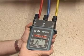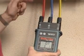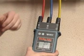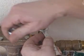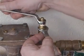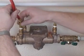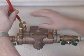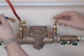The test kit has 3 control valves and corresponding hoses. From left to right, they are the high side, low side, and finally the bypass. Install an adapter to each test cock, ensuring that they are leak-free. Connect the high side hose on the test kit to test cock 1 and ensure a tight connection. Connect the low side hose to test cock 2.